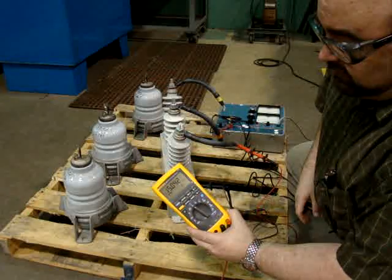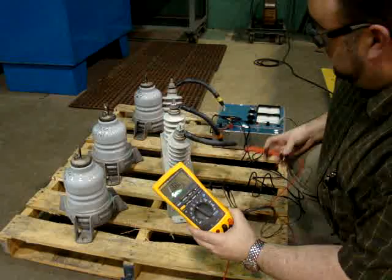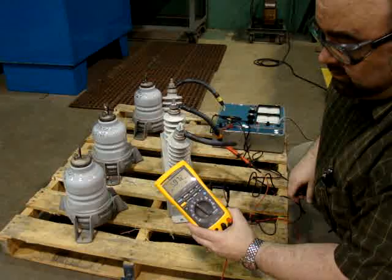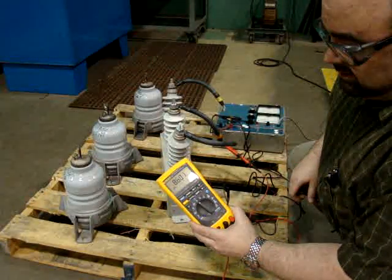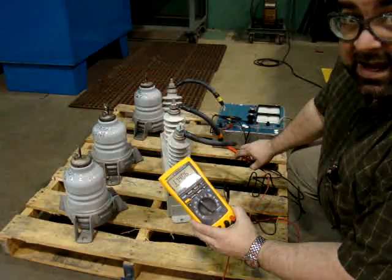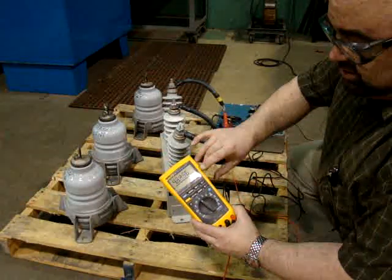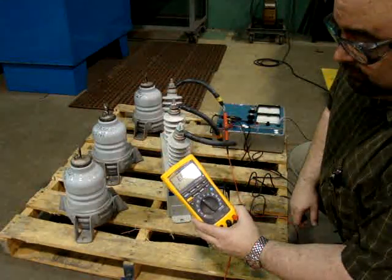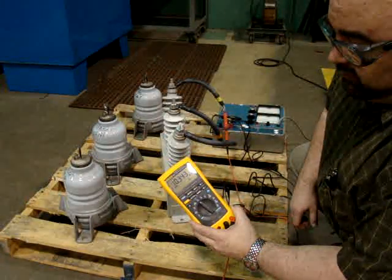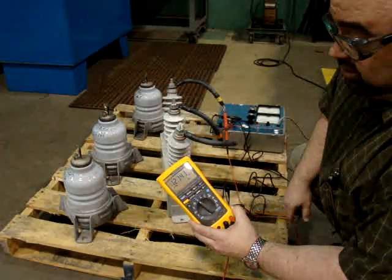In this case, I'm reading 15 megaohms. Because it's a capacitor, the reading is counting down, and now it's climbing back up again — probably because I had it charged. That's acting like a capacitor should. All readings are in the megaohm range. It should end at about 15 when it finishes climbing, and if I swap the leads it'll change direction.